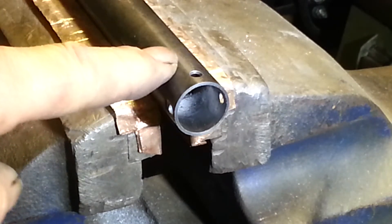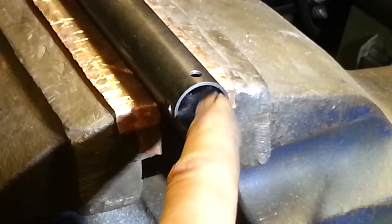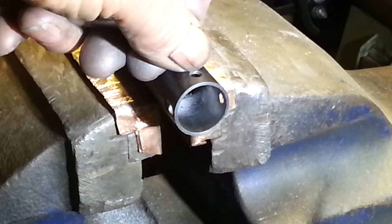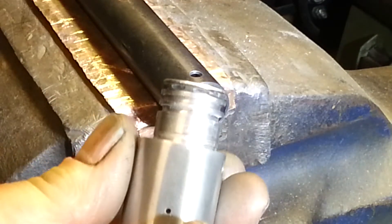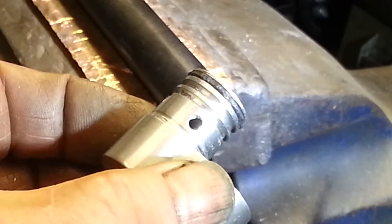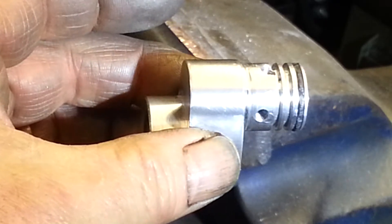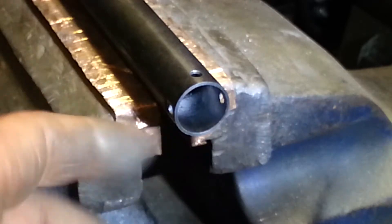When you drill a hole through a tube, the inside of that hole is like a razor blade. I'm not talking about the inside of the tube — that's nice and smooth because I've been into it with a file — but the inside of that hole where it meets the edge is literally like a razor blade. If you push a drop block in, the o-ring will become scalloped. This drop block is for a pistol so it's considerably smaller, but the same will apply to any o-ring pushed inside that tube.